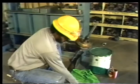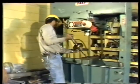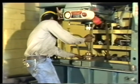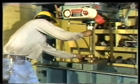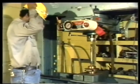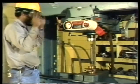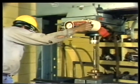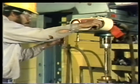With the impeller loosely in position, set the rotor in the arbor press with the impeller resting on its supports. The retaining nut must be located above the impeller. As we mentioned during disassembly, always place a protective cap or a center finder on the end of the shaft to protect it. Don't forget to protect your eyes also by wearing your safety goggles. When you're satisfied that everything is properly lined up, turn on the press and lower the piston onto the protective cap or the center finder.